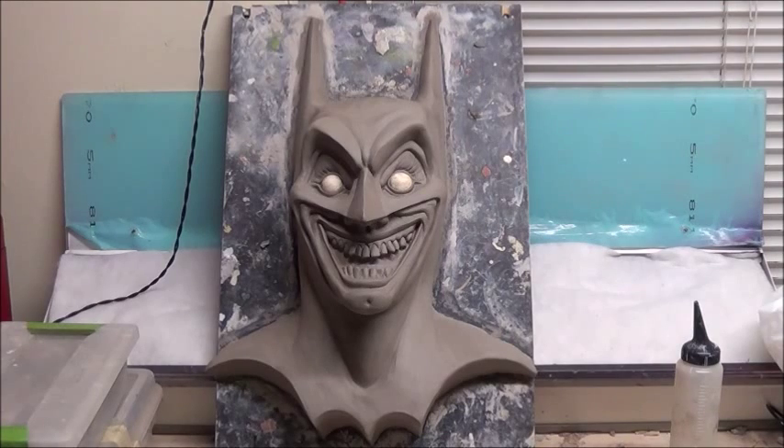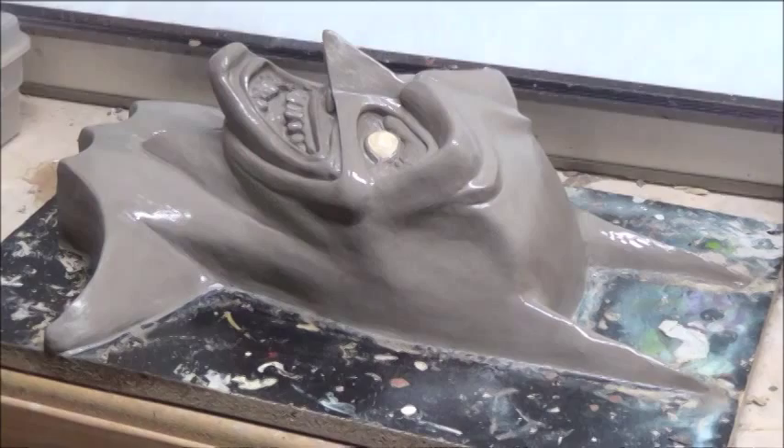Here is my sculpture. It is in wet clay — a water clay. Now that I've finished with it, I'm going to spray it with crystal clear. I've sprayed the sculpture with two coats of crystal clear. The reason we use crystal clear is to protect the molding surface from the clay, being that it's water clay. Sometimes water clay reacts differently to different molding mediums. Also, we want to protect the surface of the sculpture from getting marred or damaged by brush strokes.